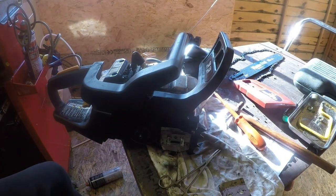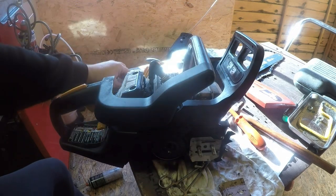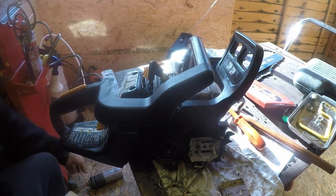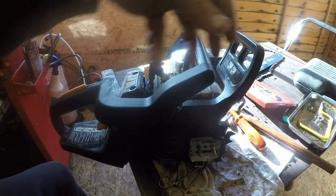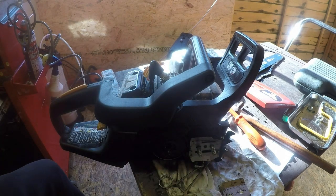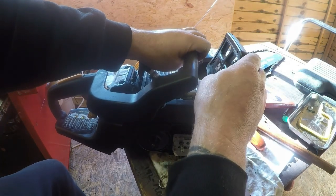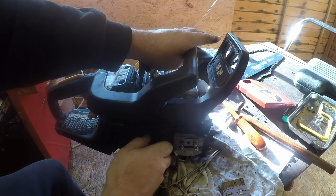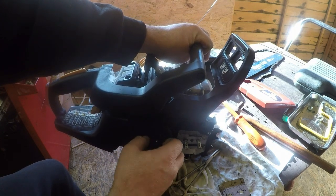Back. I'm not even prepared to discuss how hard it was to put that circlip on the back — trust me, you know I had the patience of a saint, but they were tested to the max. Every single time I tried putting a circlip on, it just fell down the back — you just can't get access. So what I did in the end — I've got some star clips. These are quite cool — that just fits over the end of this bolt and fits on there. So that's now sat just inside there, it's now fully functional. Brake on — nothing moves. Brake off — it spins.